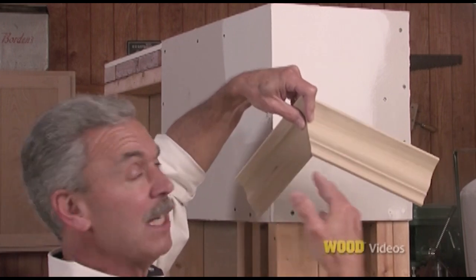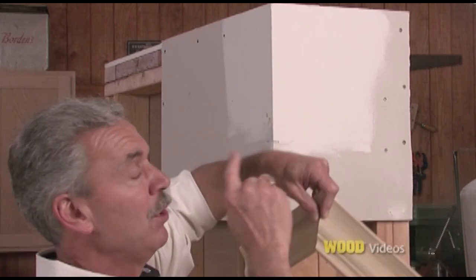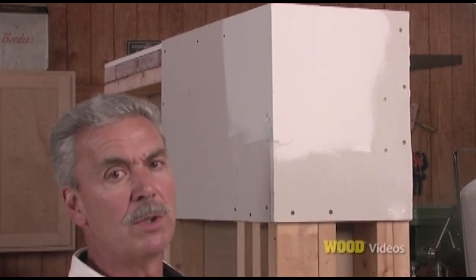Glue the joint together, keep the nails away from the outside until the glue sets up well, sneak your nails a little closer, and use your caulk to take up those irregularities. You'll have a beautiful 90-degree corner and no one will see it.